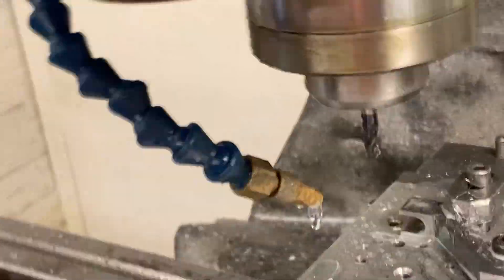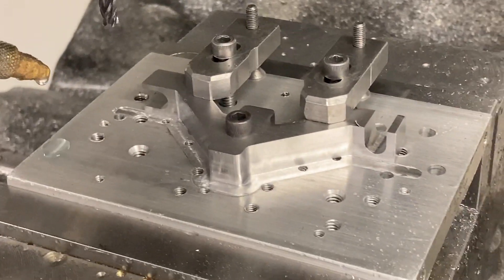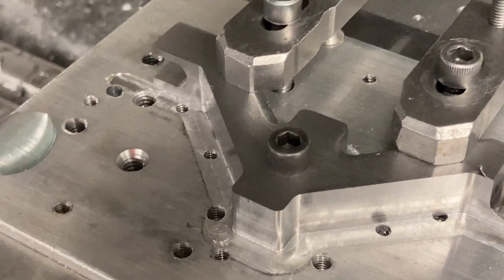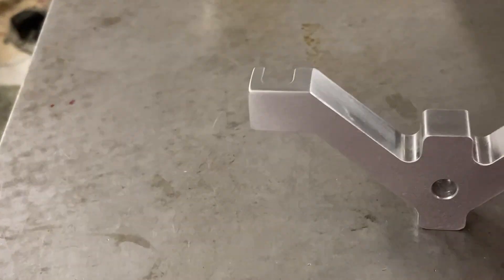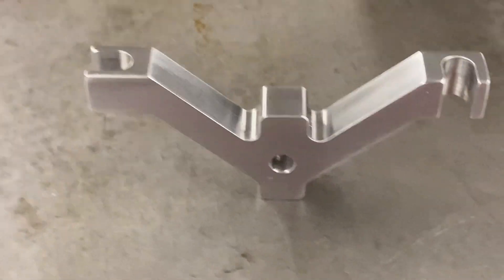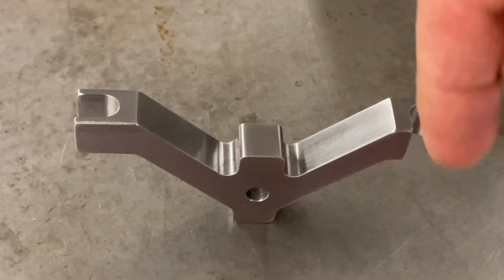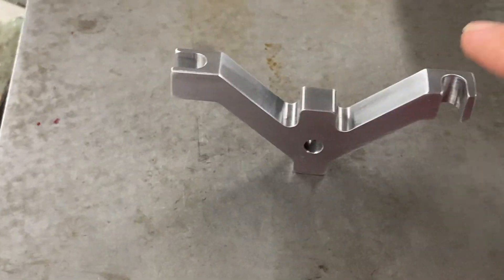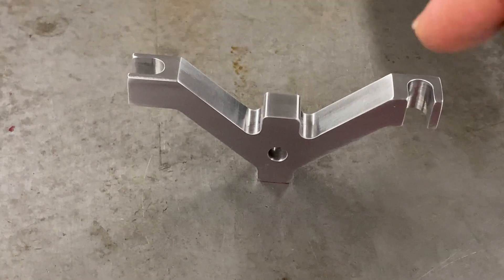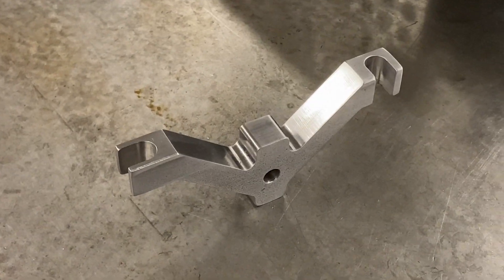All right, shut that off and pull the chips away — and that's what we've got. We've got our V-block clamp. I did that operation in the upright position. The material was square, I had it in the vise just like that. I drilled the 312 holes this way while the material was still all solid — drilled those holes about three-quarters of an inch deep since the stock is half an inch, so I had the holes on the centerlines. Then I cut a slot going this way, and a slot going that way, before laying it down on the fixture to cut the outside profile.